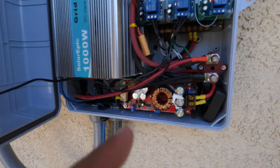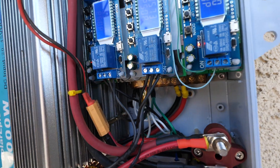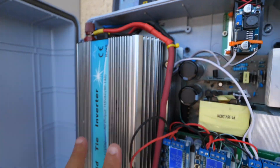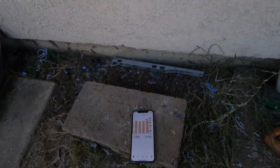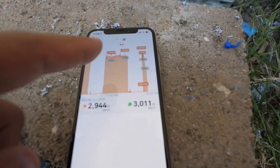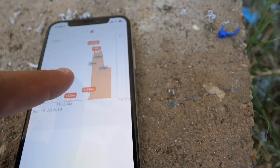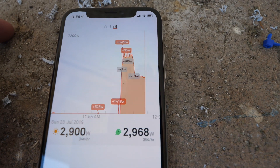There we go. So these are triggered now and the timer started — 600 seconds, about 10 minutes. The battery is now drawing 2.2 kilowatts and shoving all that energy from the battery into this grid tie unit here. Here is the effect: you can see a normal cycle, and here is the cycle where these inverters turn on. It took a little while for them to kick in since it was the first time, but about half of that energy is coming out of the battery.